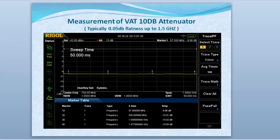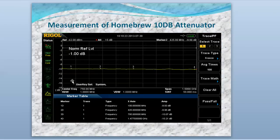Now we have some measurements of ones that we've built. My 10 dB homebrew one had different connectors, but it showed about 0.28 dB of flatness across the points I measured. I tried to pick spots that were highest and lowest to get the maximum amount of variance for testing purposes. And then the next one — a 20 dB. This is mine and it came out really good. It's about 0.05 dB across the same span as the Mini-Circuits 10 dB attenuator — actually all the way across 20 dB. I was really happy with that.